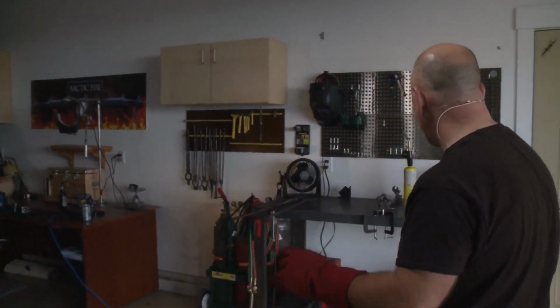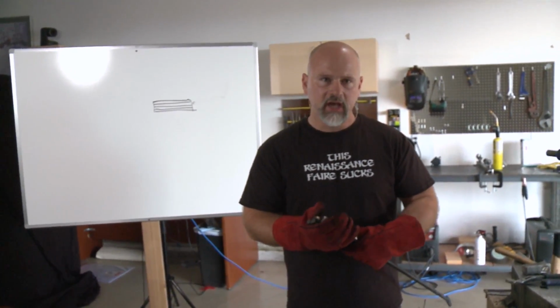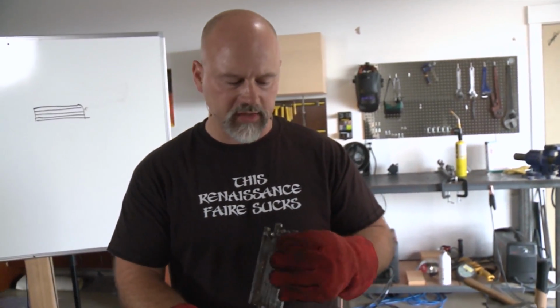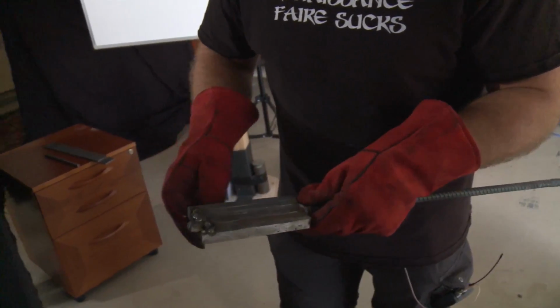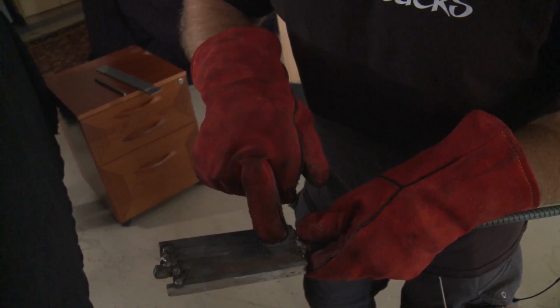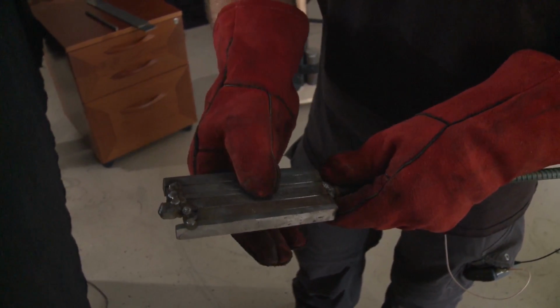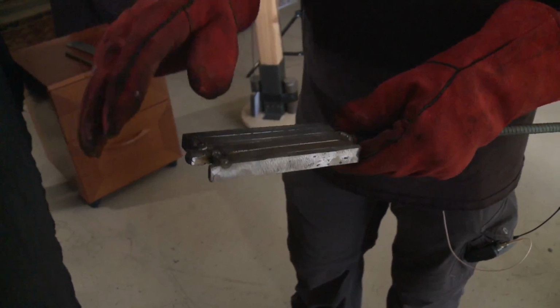Let me tell you about some of the other stuff I'm going to be demonstrating. When you saw Owen doing the plasticine demo, he was talking about how multi-bar welding is challenging, especially if you go with a tall stack this wide. So I've got here a fairly narrow and tall stack of multi-bar, and here I've got a straight laminate on its edge, 16 layers. I've got 200 layers of crushed W's, which I'll explain if I have time. Another straight laminate, and then two high density, about 600 layer bars right here. This is going to form a kind of modern looking sax.